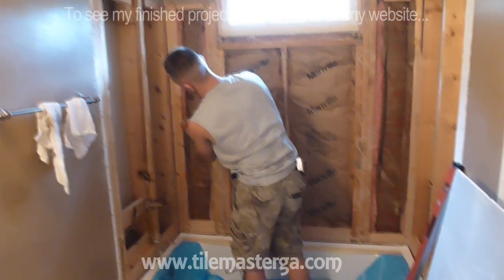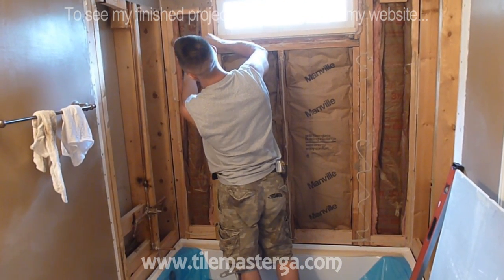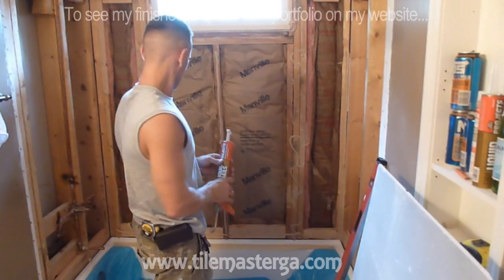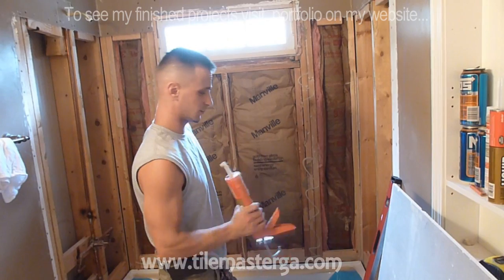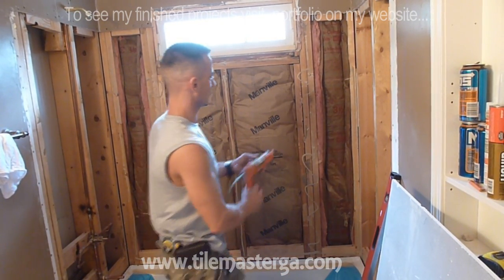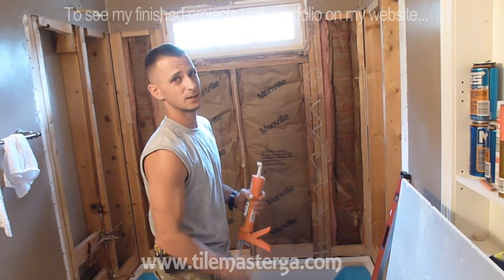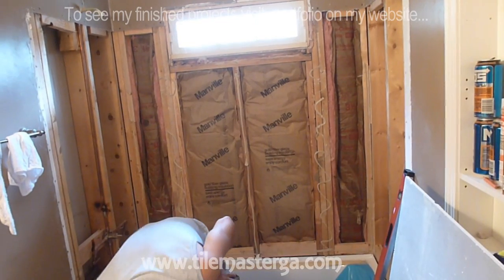Yeah, the other type of board that I'm using is a Wonder Board. So Durock, Wonder Board or Permabase. Those are good products to be used. I'm not really into Kerdi. Kerdi, in my opinion, is a ripping off of the customers, the homeowners, because it's pretty much designed for homeowners that have no really good knowledge about how things can be done. It's expensive and it can be done just as well for way less. And easier, because Kerdi is a messy product. So I'm not really working with that.